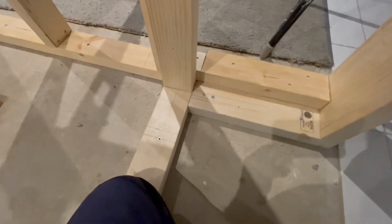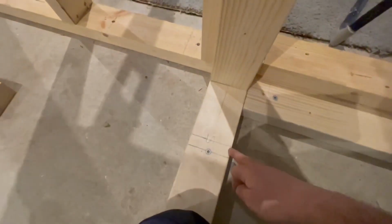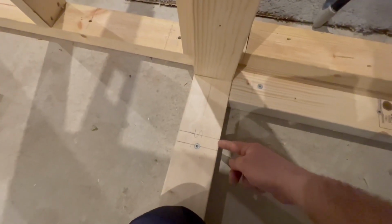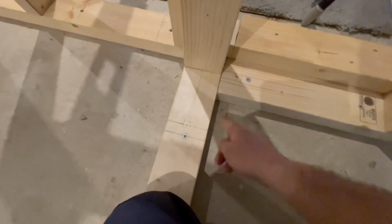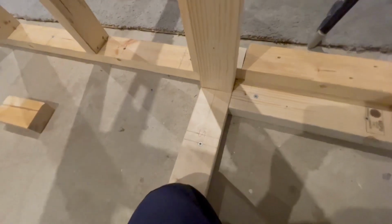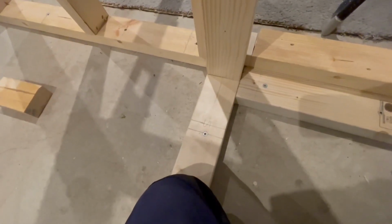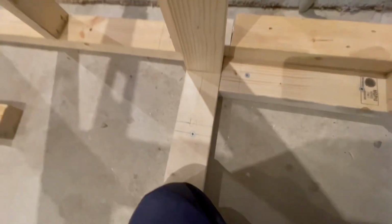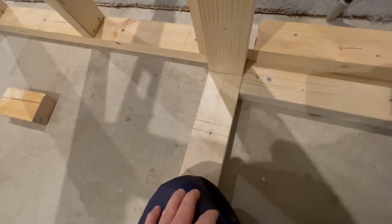And that's how that's going to work. And working from that wall to this way, we're due for a stud here to get our 450 spacing right, which is why we've got one there. I mean, it's a bit of a waste, but it's the 450 spacing. And if I didn't have it this end, I'd have it at that end. Look, you could take it out, but then you wouldn't have 450. You'd have, well, there's probably another 150 mil there. You'd have 700 nearly.